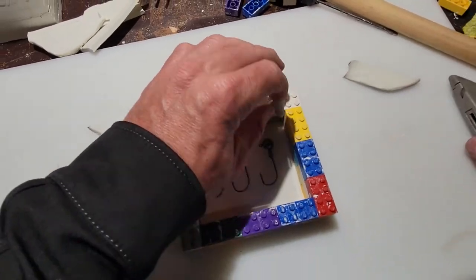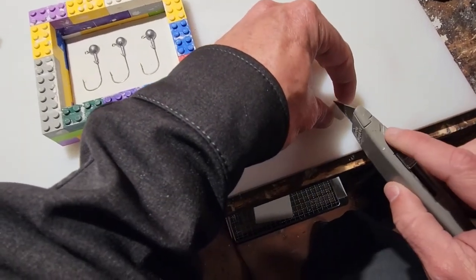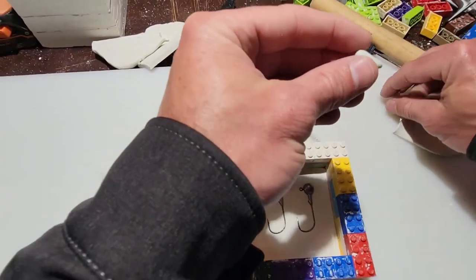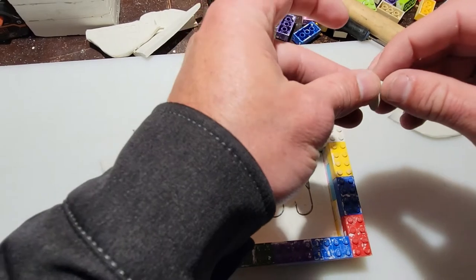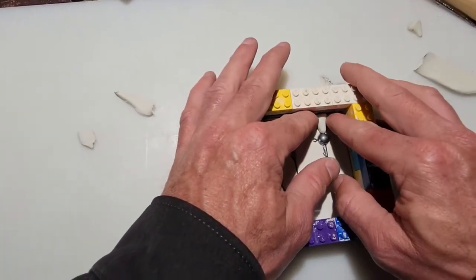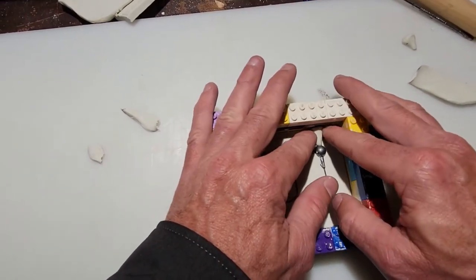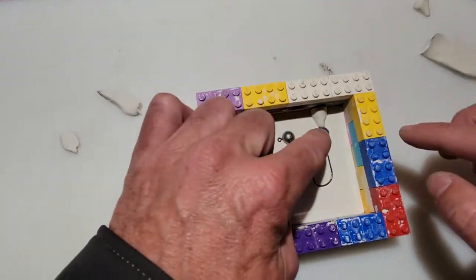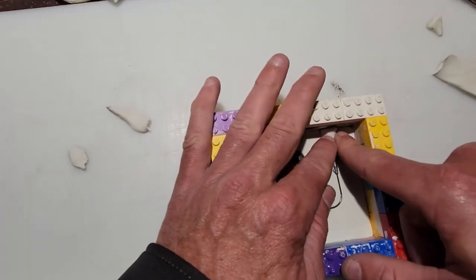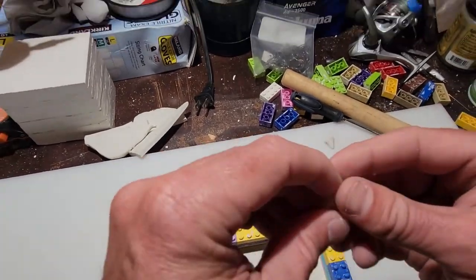So now again, similar to when I made the previous video on the micro jigs, now we're going to cut this in half, so we'll need the other half for when we pour the top layer of plaster. So you take this, put this all the way up against the container and push that down snug so it's right up against the head of that jig head. Okay, so we'll leave that top over here. Go ahead and make another one.